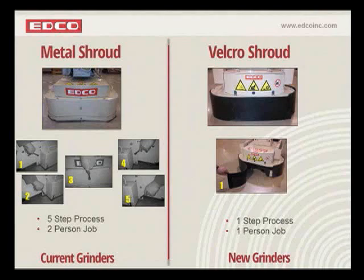Can you go over the new Strip-serts, the slide-on Strip-serts? They're now directional compared to the old ones. You want to explain that one? Yeah, that is something that is different, and they are clearly marked. Because of the way they attach, the discs are counter-rotating. With the wedge system, they weren't directional because you could use them on either side. But with the new system, they are directional, but they are clearly marked, a left and a right hand. If for some reason somebody were to put them in backwards, they just wouldn't perform that well. It's not like you're going to ruin it, though. It just wouldn't perform, so you'd say, oh, well, you got them on the wrong side, switch them around. But we try to make that as clear as possible.